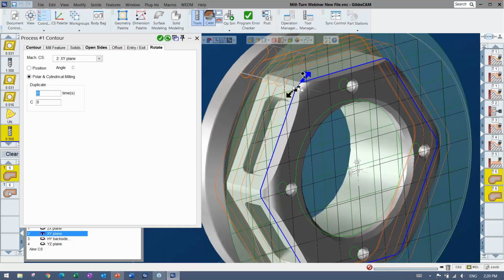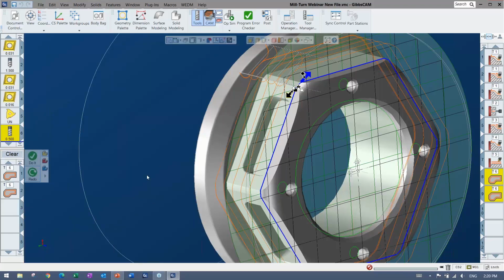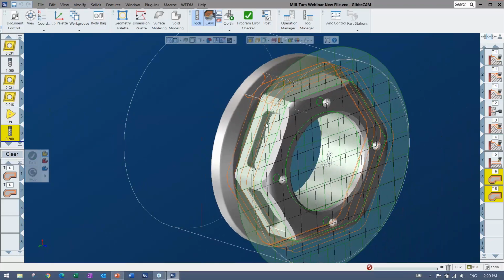And again, everything I'm throwing in are paired up, but they don't have to be. If you want to separate your roughing and finishing one by one, that's fine too. Or you can throw them all in there if they match, if they go together. Things like spot drill, tap, and you never have to look up the pilot hole size anymore. And it loads in with all of the right feeds and speeds and everything. Right, so nice and easy.